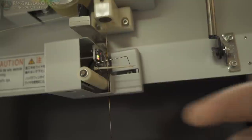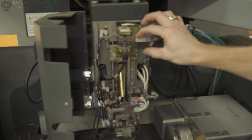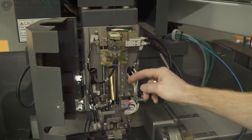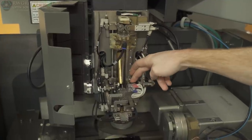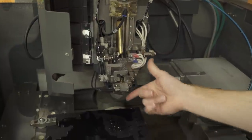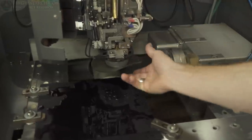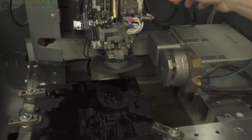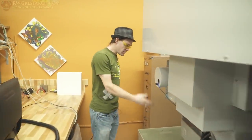And then another wheel. There's a laser here which is also a sensing device, as well as another guide, so that the machine knows the wire is not broken. Then it runs down into what they call an AT automatic threader. This can pop open — there's a couple of pinch rollers and guides, and a cutoff. This is an electrical cutoff, so if you want to break the wire, it actually breaks it through high current. And a couple more rollers, then there's a ceramic — actually an alumina ceramic — nozzle, which comes out through the bottom.